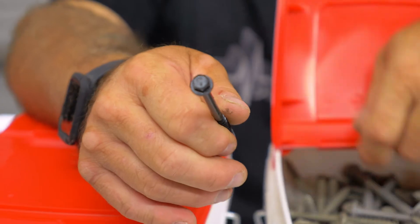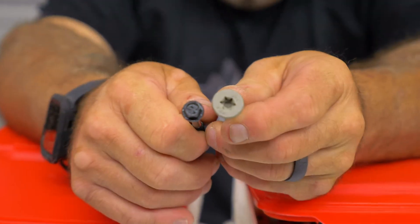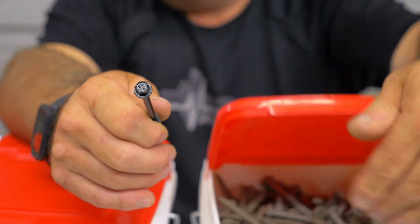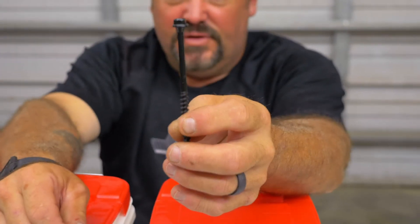It's a minimal intrusion, so you're not creating a larger opening like the ledger lock. Sometimes I use these to fasten things together too — you can see in comparison the difference in head sizes. This fastener is also black, and I've had a lot of luck with them staying that color; they don't bleed and they look really good in finish work. So if you want to pre-drill, set the depth, that kind of thing, this fastener might be the answer for you. A lot of local lumber yards can get this. I always order in bulk because you get a better price — some stuff you can get at Home Depot in smaller packs or in buckets, but I'm always ordering from my local lumber yard.